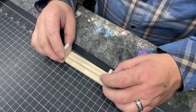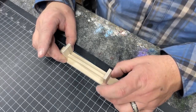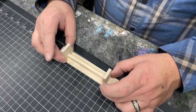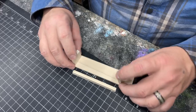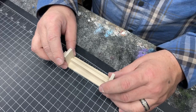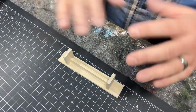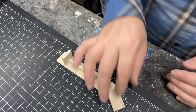All right, so now we have an opportunity to make this slightly more refined than basic, right? We go in with basic shapes, basic rectangles here to fit this little bench together. It's gonna look like that, right? We can take what we have here and just fancy it up just a little bit if we want to. And for the stuff that's under the tape, the bench top, the seat, it's good to do this now before you glue it. So it's just something we can do.